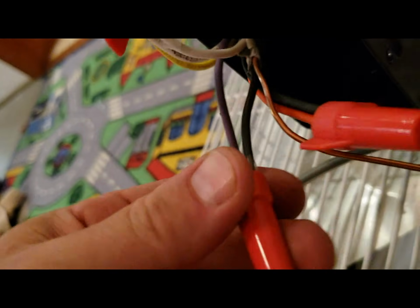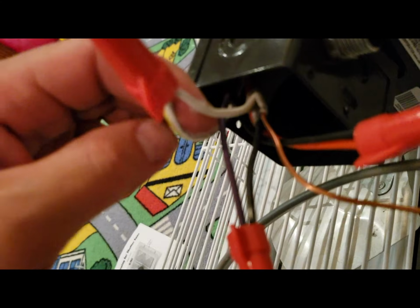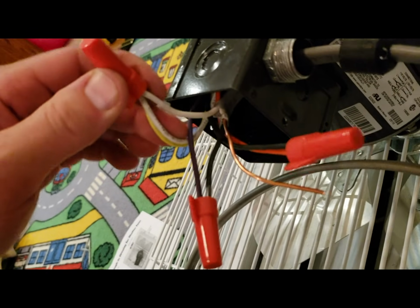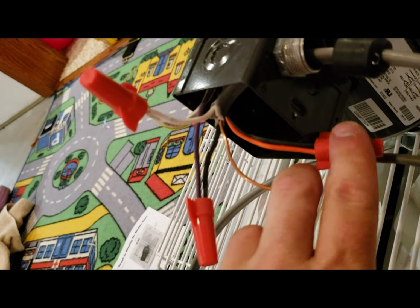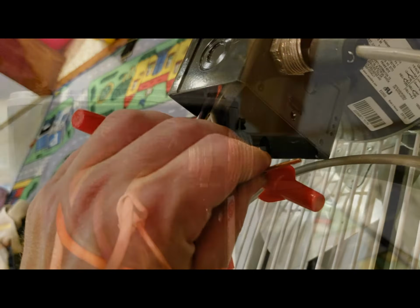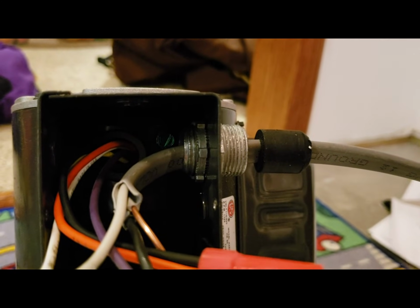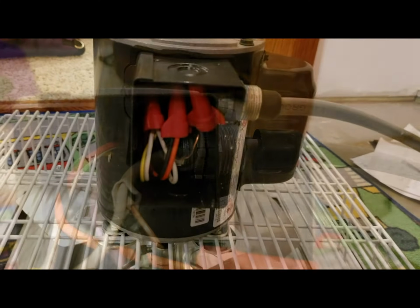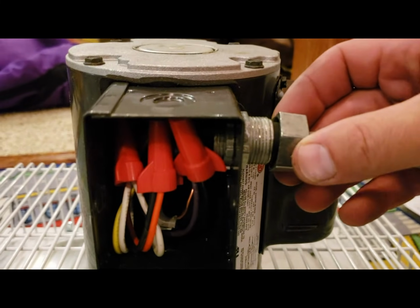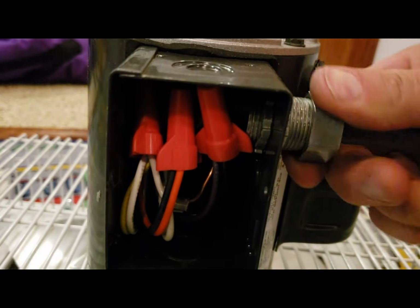Again, I'm using the 110 volt diagram there where line 1 is purple, and then my hot goes into that, and then the yellow and white go into my common. My ground coming in will screw to a set screw in the back, and I just cap the red and black because I'm not using them, since they're for 240. I know there's a little green screw in the back. I don't know if you can see it. It's for the copper.